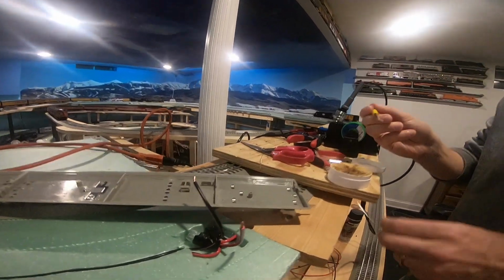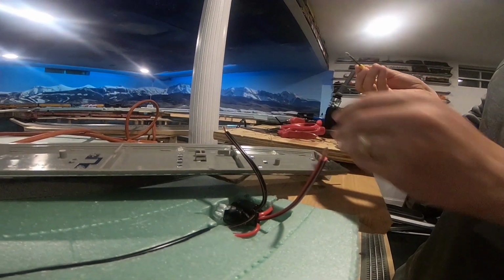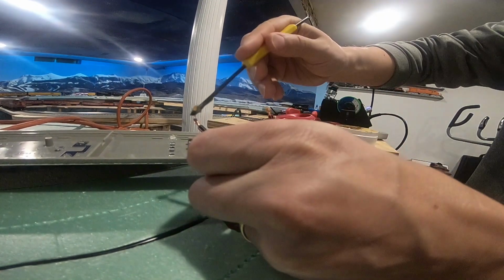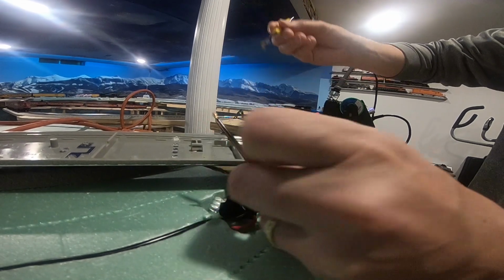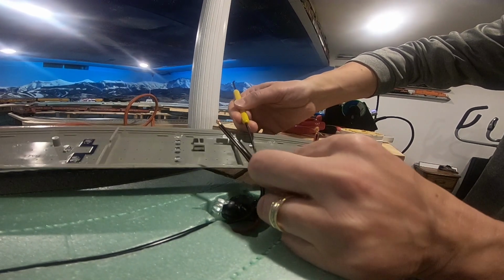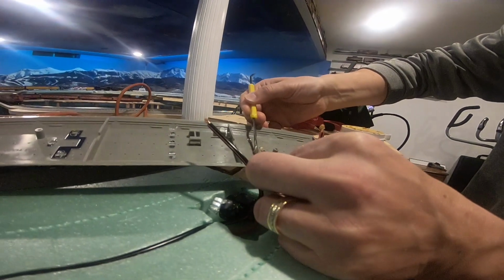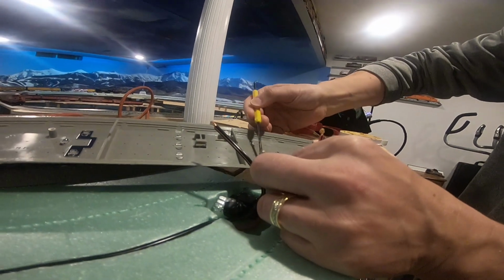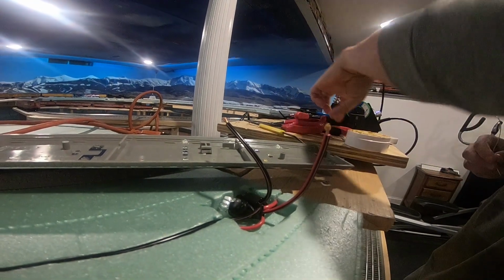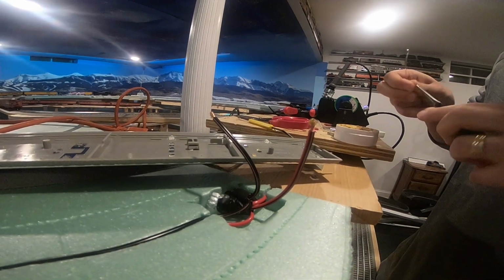And what I've been using is the flux and a little bit of this little spatula tool, and you want to pre-tin your pieces. So a little bit like that, a little bit like that. This is with the flux, and then we're going to put some on each connector, right there, and a little bit right there, a little bit like that. And this will give you a good place for the solder to flow to. Alright, and so I take a small needle nose plier like this.